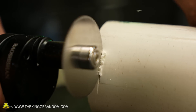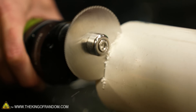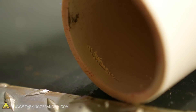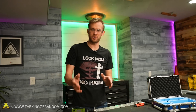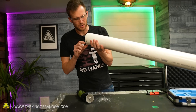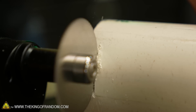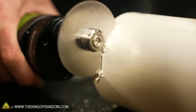Let's see if I can get through this PVC pipe. If you look on the inside of the pipe, you can see I cut all the way through — it's a decently thick wall of PVC. The rigidity of PVC combined with the not-as-hard-as-metal nature actually works quite nicely. It's not the most efficient way to cut through it, but if you happen to have this kind of saw and a piece of PVC, it'll cut through. It was cutting more than melting, though there was some melting too. PVC — pretty good, works okay. If I had to cut the length of the whole pipe I wouldn't be thrilled, but I could do it.